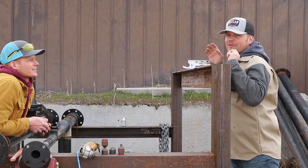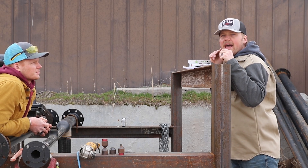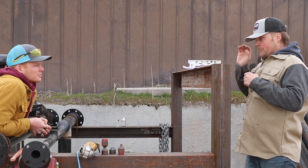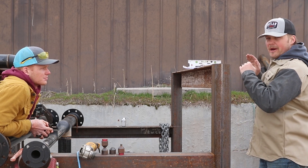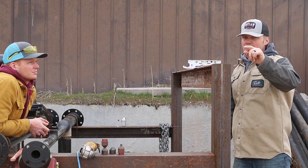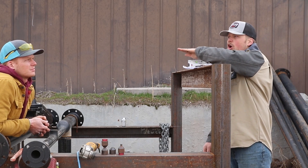When we level this thing up, 7/16 is a big gap to try to weld. You're not going to be able to weld that with stick — it's going to get cut out, it'll pull too much, it's going to ruin everything you're trying to do. That's the difference between just barely being out and being level.